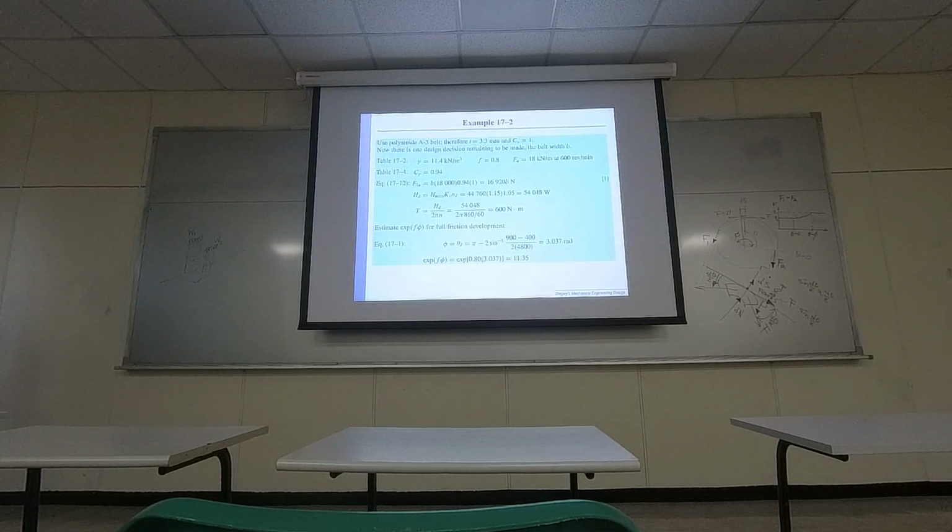So I didn't cover everything, so I will just talk about the things I covered. Let's say you figure out the friction coefficient 0.8, and this is basically the power. I didn't talk about the correction, it's like the effectiveness of the power. So the required power is 44760, but your motor needs to have this amount of power in order to drive it, because of energy loss and some other issues. So let's say you just have a motor that can generate 44760 watts of power.